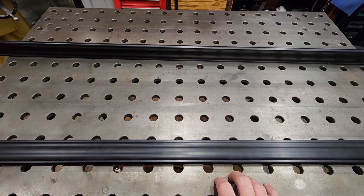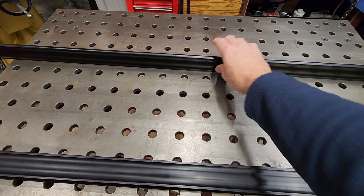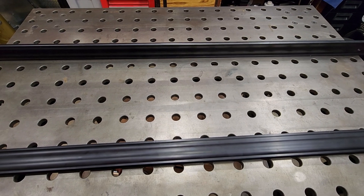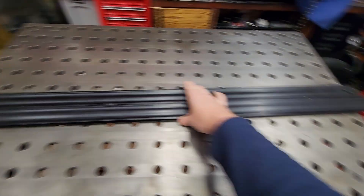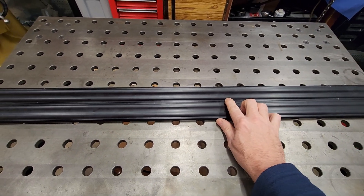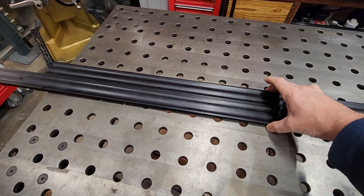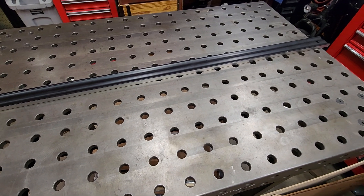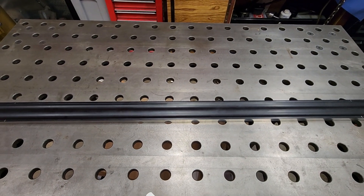I've got these relatively inexpensive but very effective straight edges. I thought I'd do a few measurements here. I can't attest to how accurate or flat my straight edges are, but I have two of different lengths and when I put them together there's not even daylight between them. That tells us they're the same — not necessarily flat, but it's very unlikely they're both identically far out. So we'll assume that's the best straight edge I've got. I've also got some shim stock — a feeler gauge I've taken apart — with 3 thou, 4 thou, and 5 thou feeler gauges.